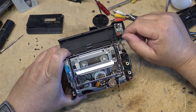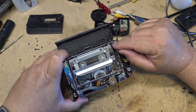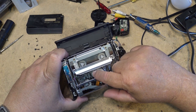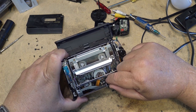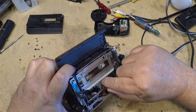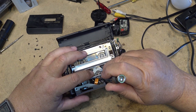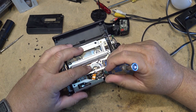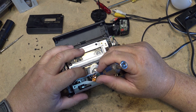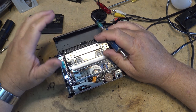This was the mini, or the compact, as they called it, compact 8mm chassis. The tape was threaded 360 degrees, almost 360. It used four heads, and the heads were spaced at 90 degrees on these. Basically how it works is the first head makes contact with the tape here, and it records all the way around to here. And then the next head is the one that's 90 degrees out of phase with the first one.